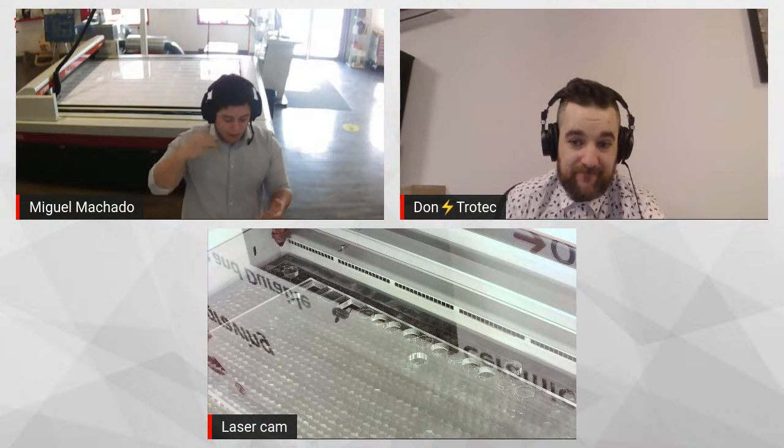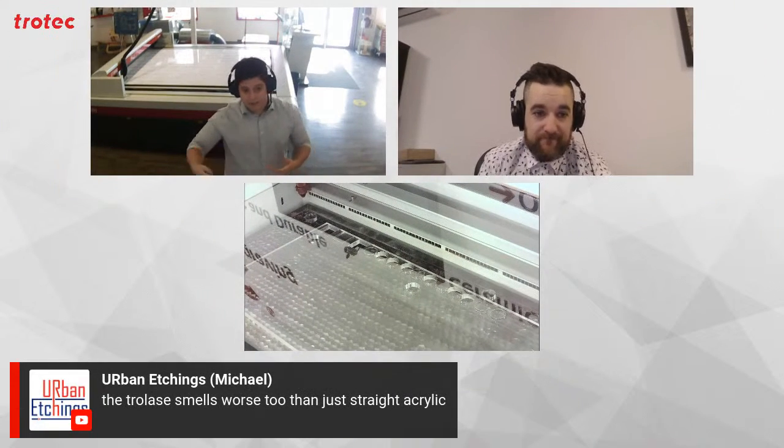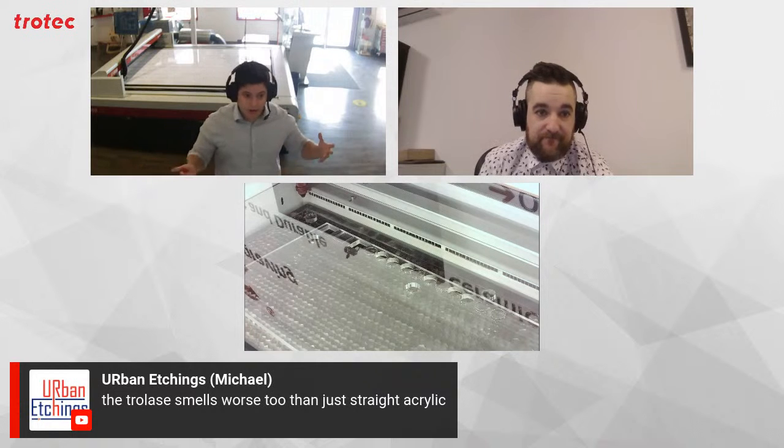Basically, the acrylic, while it melts, resolidifies so quickly, and there's a gas buildup while you do that. So if you have this nose cone, it will make that as fast as it can. It will cool down the acrylic and it will solidify. That's why you see these serrations. When you don't want serrations but want to keep going fast, you go with a wider nose cone so it doesn't flame up, but it will maintain your speed.